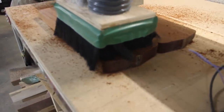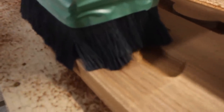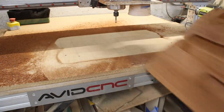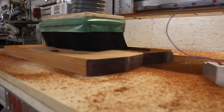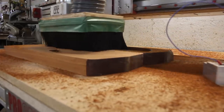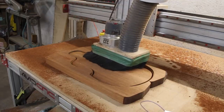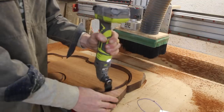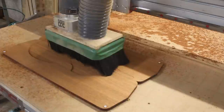You don't need a CNC to do this type of woodworking. It can be done by hand, but with the CNC you do a lot of the planning on the computer first and then finish it by hand. I've recently become infatuated with CNC woodworking and I have this beautiful Avid CNC machine. I designed these files in Vectric and then cut some prototypes out of MDF to check them before going to the real deal. You can see I have these subtle curves in the shape of the body and that could all be done by hand — it's not difficult, but it does take time to get it consistent and even. But with the machine I can sort of dial it in and go.